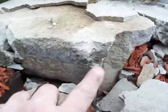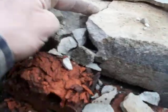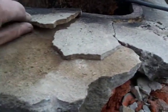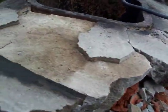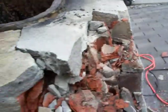The top of the brick, the original crown, was cracked. I might have done it. It obviously needed something done to it, because somebody came and put on that much. It's a mess. You can't smear a half inch of mortar over a bastardized crown. It just is not going to work for you.